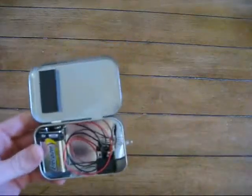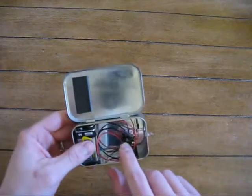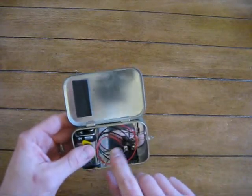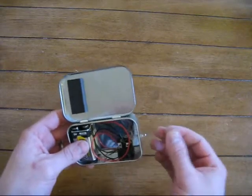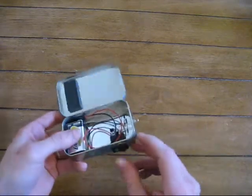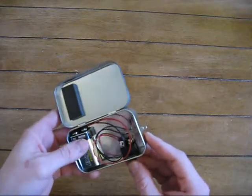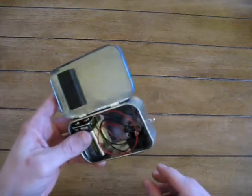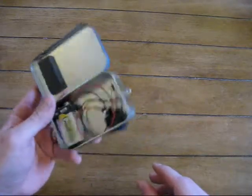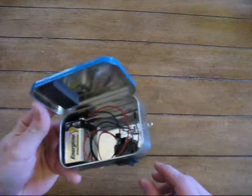As you can see, it's similar to the other circuits — there's not much to it. I'm just running off a nine volt, and this one I do have regulated down to a five volt regulator which feeds through some resistors to get the right voltage to the LED. Just a basic toggle switch — this is before I found those nice little slide switches on that other flashlight. I've actually used this one the most out of all of them; it just seems easier.